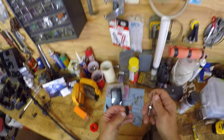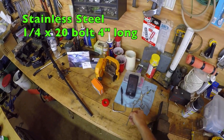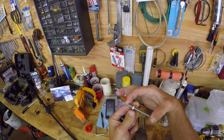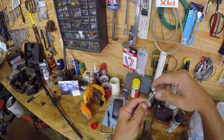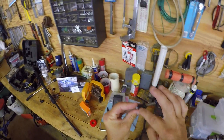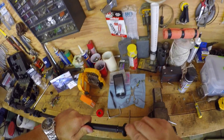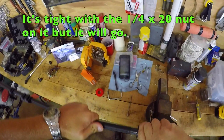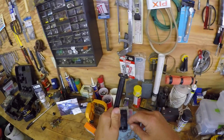So from this point, I bought a bolt from Lowe's Hardware — a quarter by 20 bolt like this right here — and then I cut it off, about two and a half inches long. Now what I'm going to do is take this, put a nut on the end of it. You can adjust that however, but I'm going to do it just like that right there. Then I'm going to put epoxy on this right here, take a screw, screw it down in there — it ain't coming out. Just like that there, slide that on down in there, and it ain't coming out, I can promise you that.